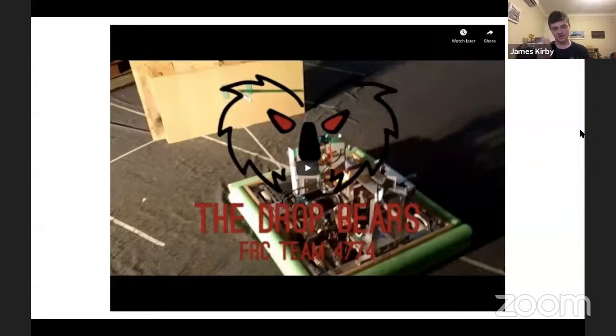So yeah, this is a bit of a more complex way to do things. You sort of need a linear slide to get that left-right motion. And then the bit was pneumatic that sort of shot out and released. But again, a great use of taking 2 linear mechanisms, combining them with a little bit of software sprinkled on top to create probably the most impressive gear placing mechanism that I saw in 2017.